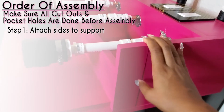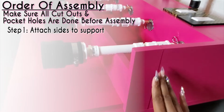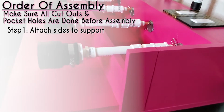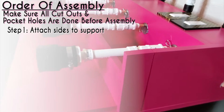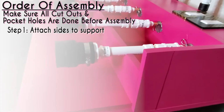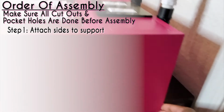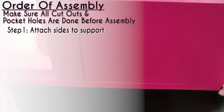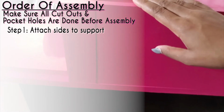That's because I messed up my measuring, but as you may recall, in the beginning, I gave you the full measurement of this. This whole thing is 14 inches. Okay, so this would have been one 14-inch piece. It's flush on the back, flush on the side. So you just match up the back, match up the side, and screw it in.